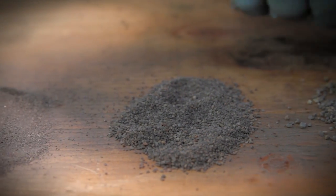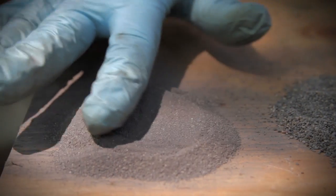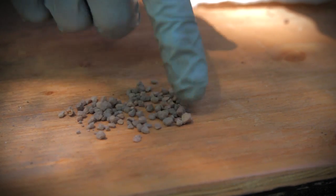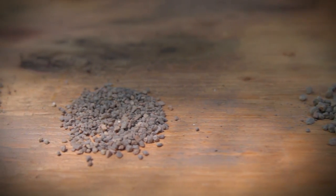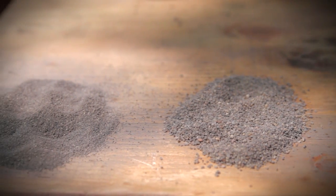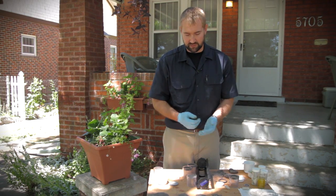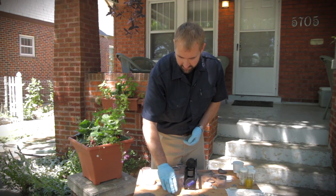Another important thing you can do once you've got all your aggregate together is put it under the microscope so you can see exactly what type of material you're working with. You can see there's a lot of very fine, somewhat quartz-y looking aggregate in this sample, and over here some stone that looks pretty typical to Colorado — some reds and everything. A lot of the color from your mortar comes from this aggregate, so you want to get it as close as possible with stone that's local. Most historic mortar comes from stone quarried from a local quarry, riverbed, or somewhere similar, so hunting down the correct aggregate will take a little work — but it can be done, especially with a list of suppliers of stone and gravel for masonry purposes.